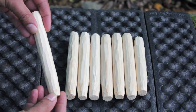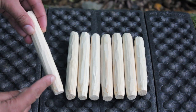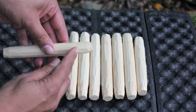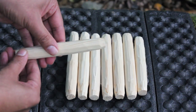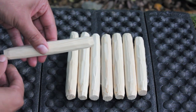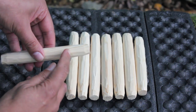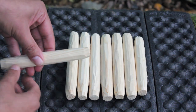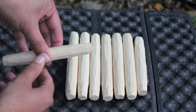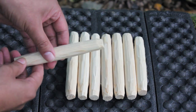Now the main thing we've learnt, apart from the width being just right, is the actual chamfering. We found chamfering helps in two ways. The bit that is going in, the chamfering helps it glide in a lot easier. We found if you just kept it at the same width, it really stuck and it was a nightmare to hammer in. So we chamfer it from about a good inch away, so it's quite a bit, allowing it to slide in a lot easier. And also another chamfer on the end, so two chamfers to make it go even narrower, allowed it to go in a lot easier.